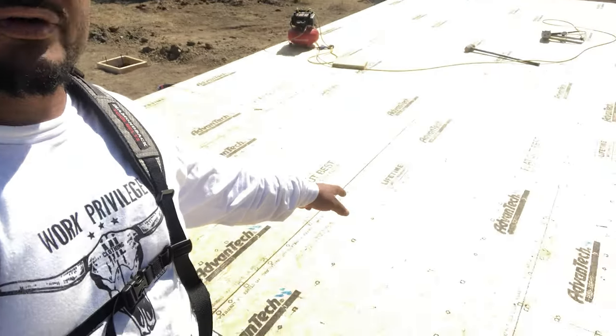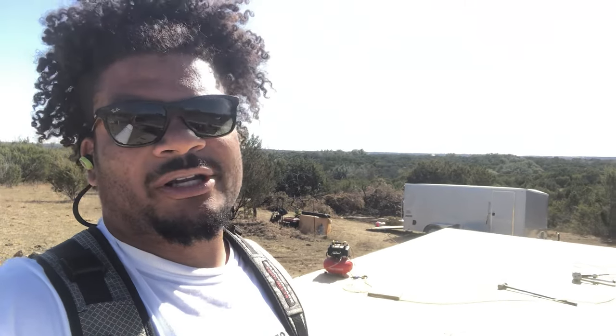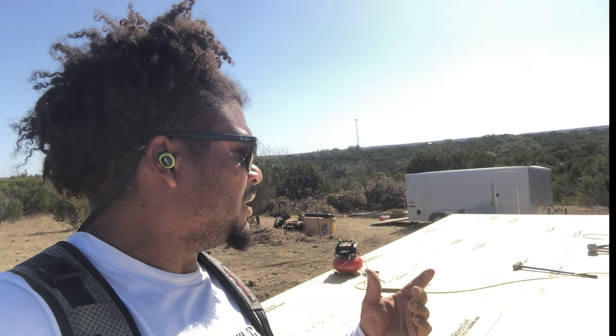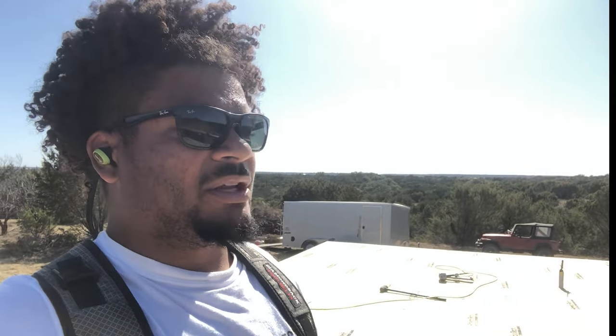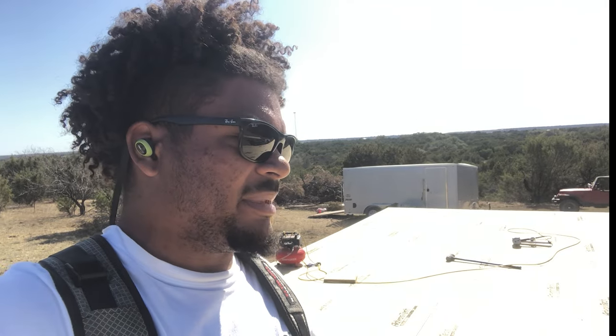The nailing grid is also just epic. Big fan of it. And man, this is sturdy. To fasten this, if you're doing dimensional lumber, it's probably best you do screws. But I actually used two and a quarter inch ring shank nails, which I loaded this thing up on, it's not going anywhere. If you have the ability to use screws, you can. I just, as a one man show, that was just gonna take me too long, and I don't have one of those little automatic screw guns.